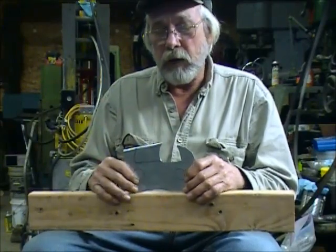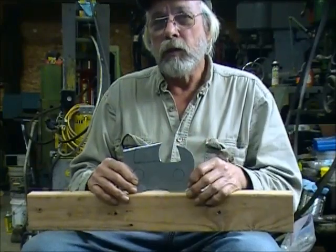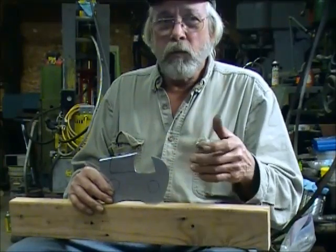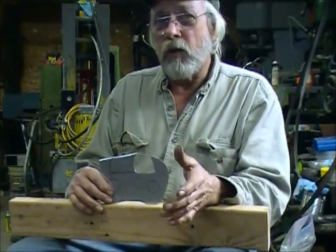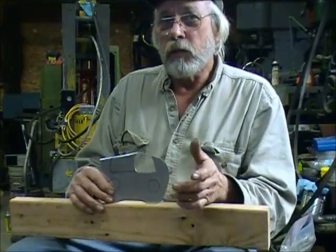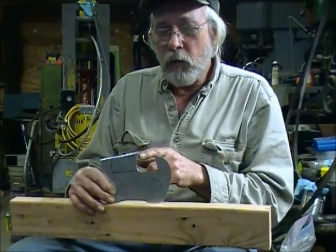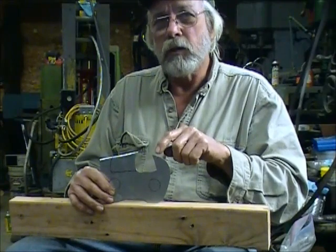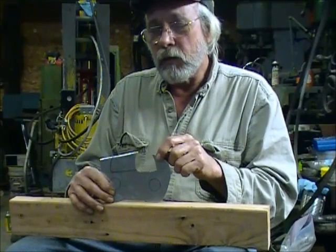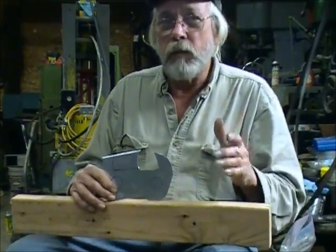In the other part of this video I'll show you about this depth gauge thing — which one I use to progressively set these depth gauges. That second part showed you that one chain where one of the cutters is like half as long as the ones on the right, and it had two cutters missing. It's not what this depth gauge is — it's what it's doing. People aren't paying enough attention to these depth gauges. It's very important to get this right so the chain cuts correctly, and it's hard to do with a file.